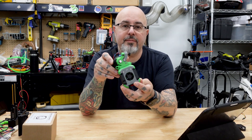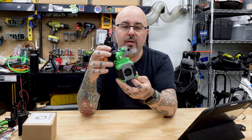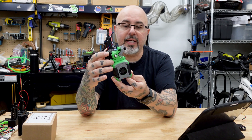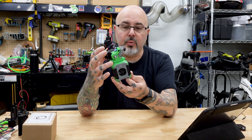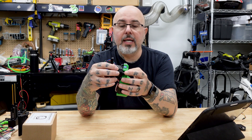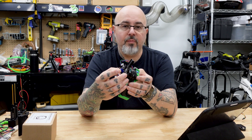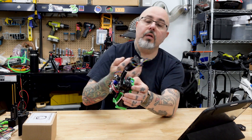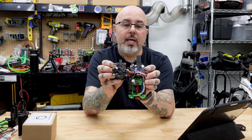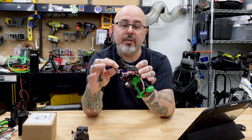Here's the completed unit. After I got the extruder built, all I had to do was measure the amount of PTFE that needed to go into the tool head to get to the hot end, then measure how much I needed to go into the extruder to hit the stop there. I trimmed some 1.9 millimeter internal diameter PTFE tube. Since this form factor is so similar to the Orbiter, I just undid the EBB36 board and moved it over. The only wiring I had to change was to cut and crimp a new motor wire. It was a really quick installation.